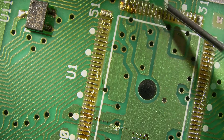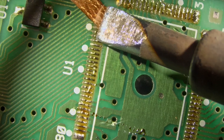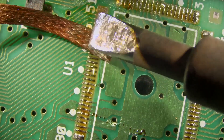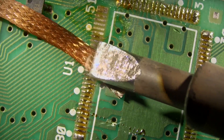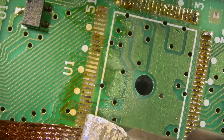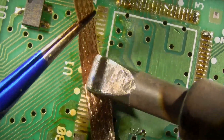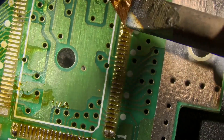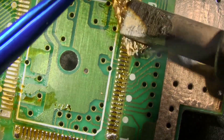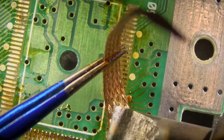We're going to add just a tiny bit of flux — we don't need any but it does help the process a little bit, just kind of a personal preference. We do use a large tip; it speeds this process up and makes it much easier, otherwise sometimes the solder braid will get stuck to the board. You can see all the solder is off those pads — nice copper look underneath. Moving over to this side, just going to kind of scrub the solder off those, just like so. With that little bit of flux on there, that stuff just comes right off into the wick.